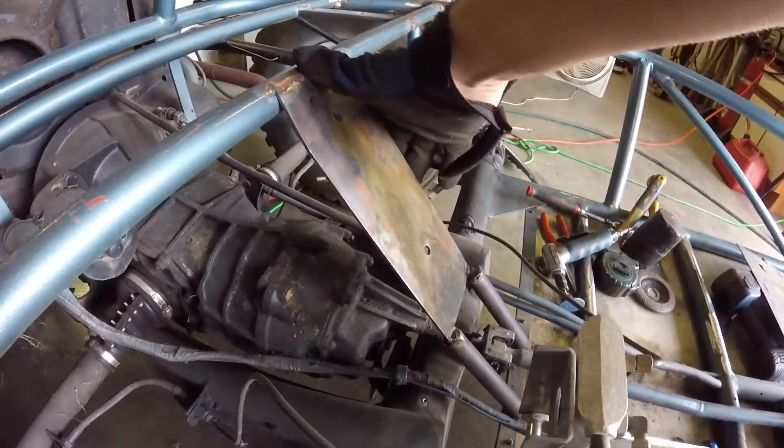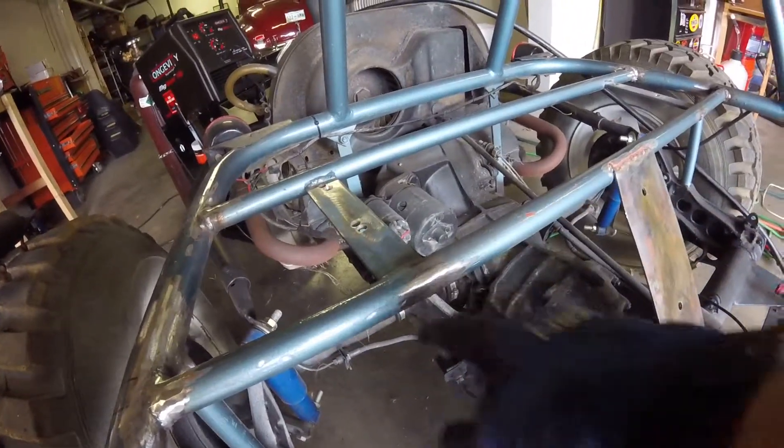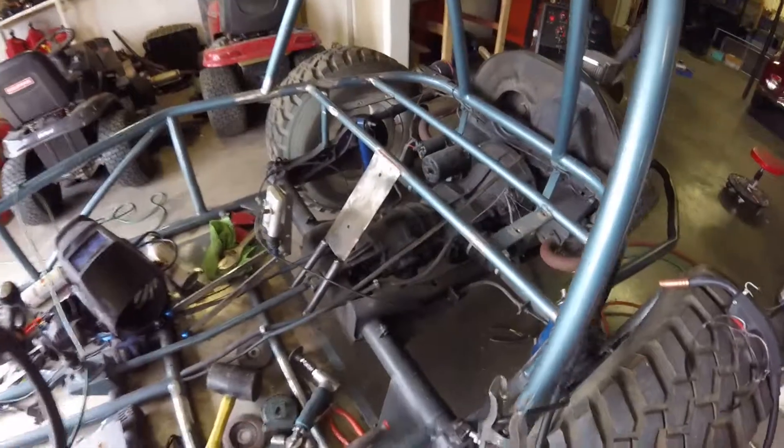This is my cut brake - or steering brake, whatever you want to call it - panel in. When it's all welded, it's pretty solid. I'm going to go back and do some more welding in a little while and let it cool off. While it's cooling off, I'm going around grinding down some of these where I did a spot weld and where that seat belt bracket hole used to be. I'm going to grind down around here and make it look a little bit cleaner. I just spent five minutes of my life looking for my safety glasses that were on top of my head. Just thought I might share that. I got all the welds ground down pretty much. I might even take some glazing putty and go around those and sand it to make it all look like one, like my grandfather did with all the other joints on this thing.